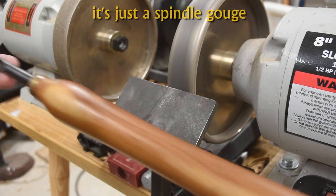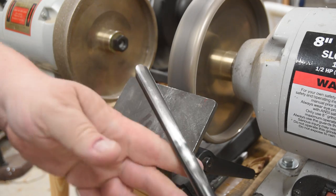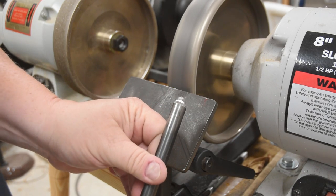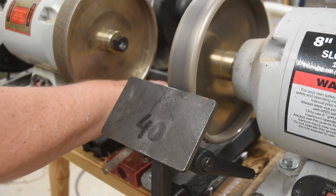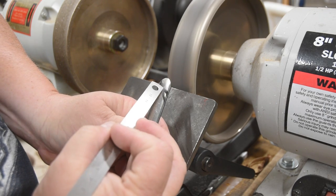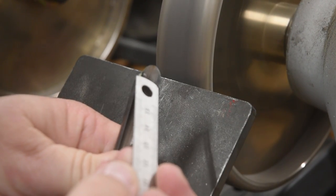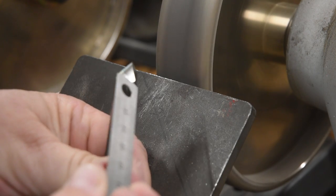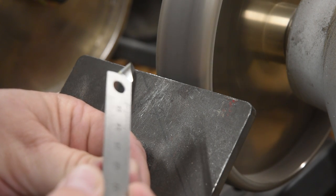Next up is my spindle gouge — my go-to tool in top making. In the last few years I've burned through one or two of these a year, that's how much I use it. This is my normal sharpening regime for it. But I want you to notice something: mine's actually a little messed up right now. Can you see this grinding point on the side? And if I come straight over, it's a little bit off — so this is not balanced. Sometimes you get a little scoop; they call that a hook, and that can make it very catchy. Or it might be proud. What we want is this to be very flat all the way across.